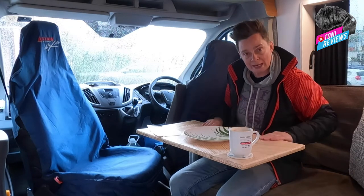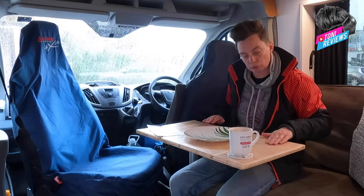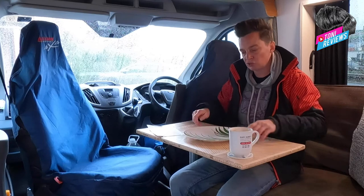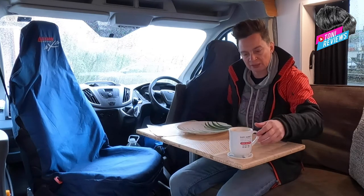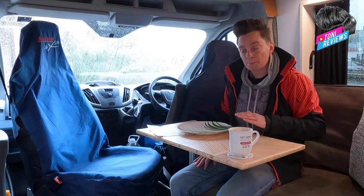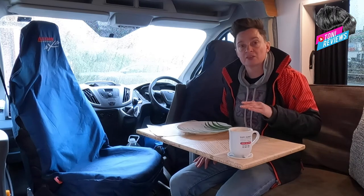I used an electric planer to try and plane down my tabletop to get it as flat as I could, and get the high spots down where I could. When you run your hand over it, you can feel very slight undulations. It doesn't make your plate bend around, and it doesn't make your cup bend around, so that's not too much of a problem for me. But if I wanted to go for a completely professional flat finish, ideally you want to run it through a thickness planer.